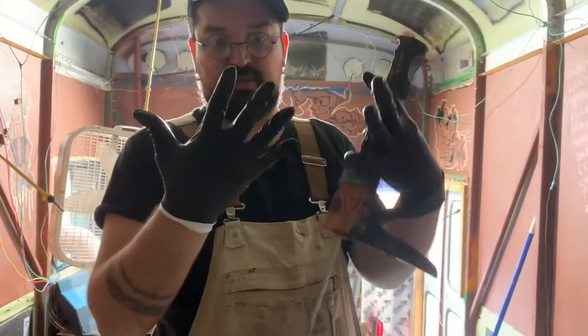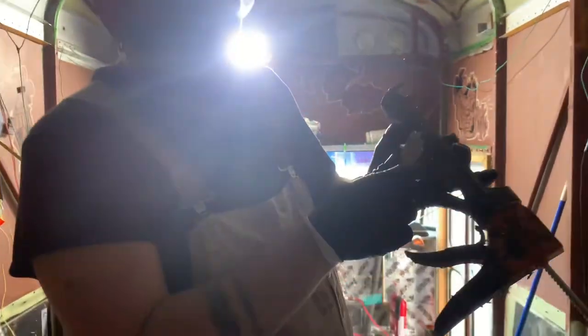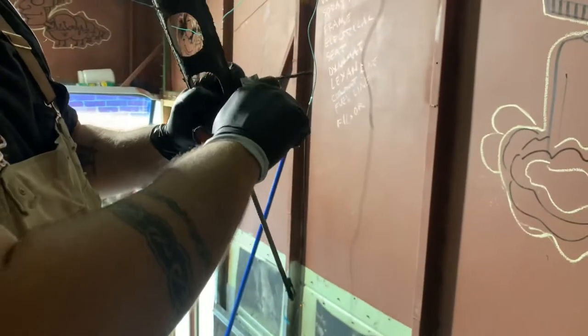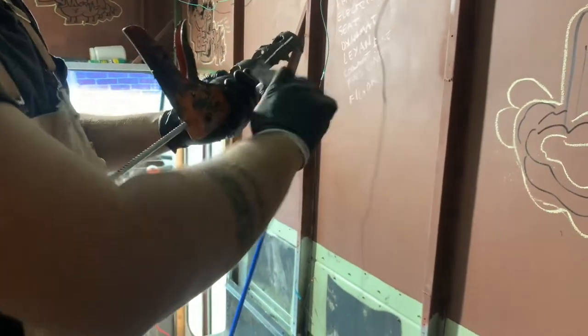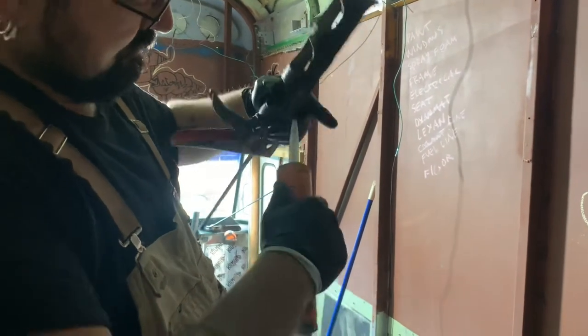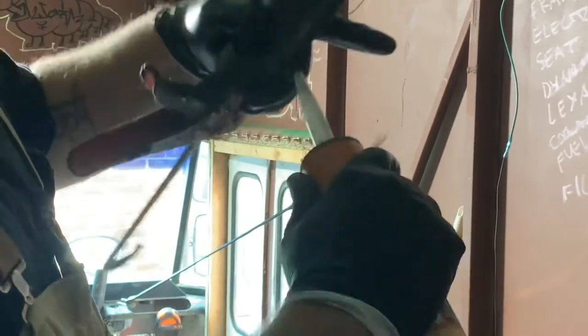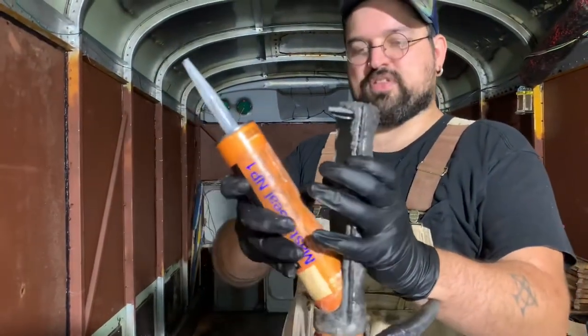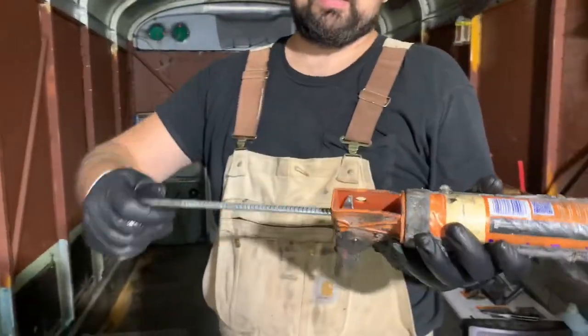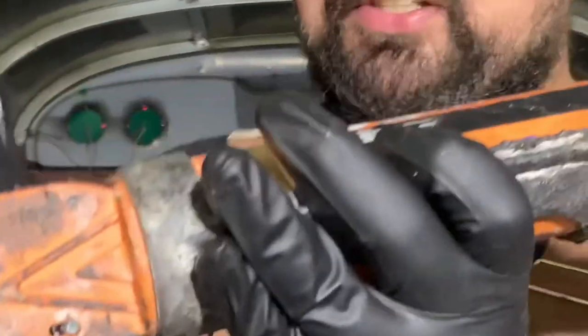Make sure that you're fully geared up — covered, gloves — because this stuff will make a mess. I'm going to use my knife to pull out the puncture piece and clean it. I'm using my razor blade to cut it down; that's up to you if you want to do this. You take that and put it inside and create as many punctures as you can — I'm going to rotate it and do it again. Inside is like a little aluminum foil type seal. Then you seat the tube in the gun over the pusher, tuck it under and snap it into place. Make sure the orientation of the teeth is downward, which as I squeeze it is going to ratchet forward, pushing the tube.